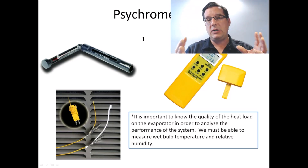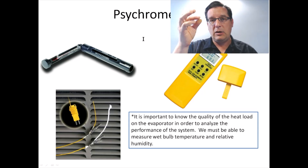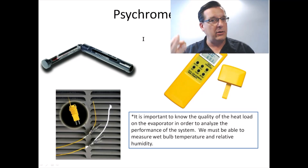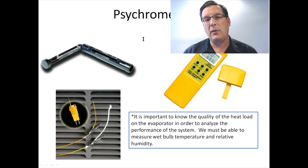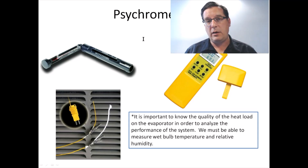Think of the air like a sponge. If you take a sponge and start adding one drop at a time with an eye dropper, at some point the sponge is completely saturated and won't hold another drop — every new drop you put in, another comes out. That is the analogy for relative humidity: when one drop in equals one drop out, that sponge is 100% saturated. Now if you took that same sponge and made it twice as big with the same amount of water in it, it can hold twice as much but only has half as much as it can hold — that's 50% saturated.